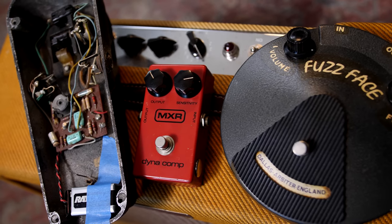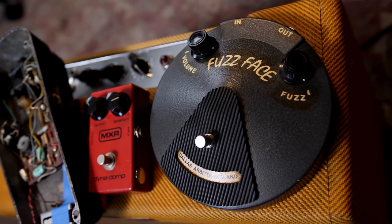That's creating the same sort of parallel loading we talked about with the volume pedal. A lot of this bypass system was a consequence of the time — back when a lot of these old vintage MXR pedals were made, the only available foot switch was a single pole double throw, and they couldn't do true bypass, nor was it something people really cared about. These devices were just used in series in one particular application, maybe in a studio, without thought that multiple of them in series would create all this extra capacitive loading.